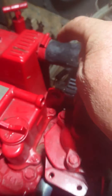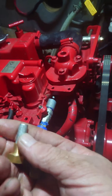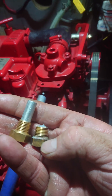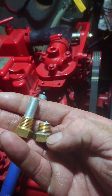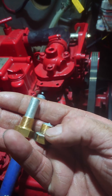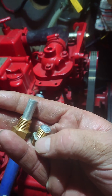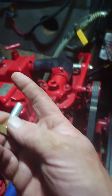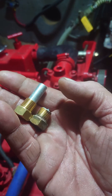It's not very easy to get to but it is doable. That's what it looks like when you put a new one in, and that's one exactly a year ago — that's why I've just taken it out now. You can see how the anode has all been used up with the galvanic reactions of the casting and the zinc, which is what we've got here.